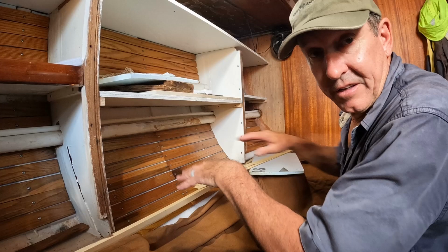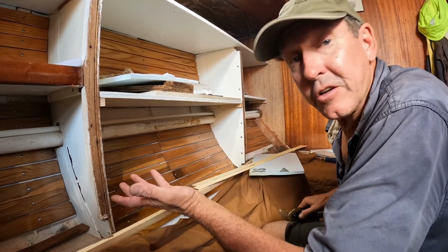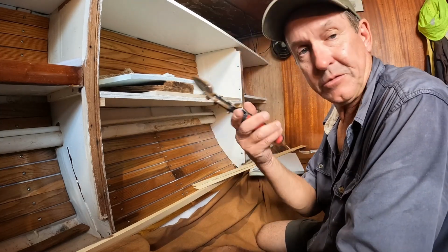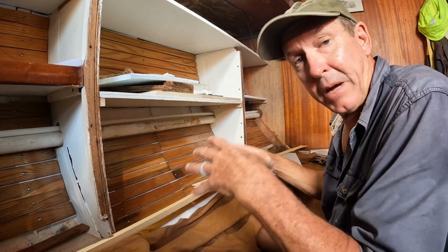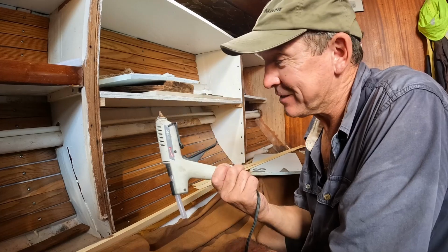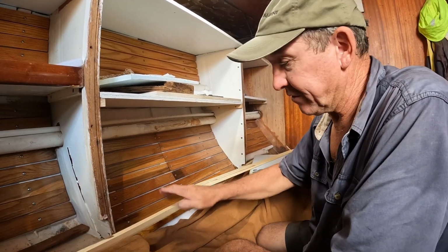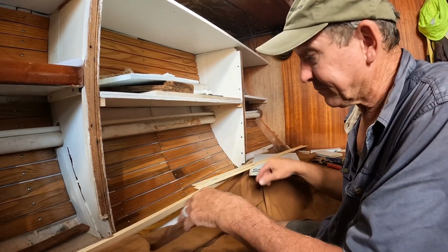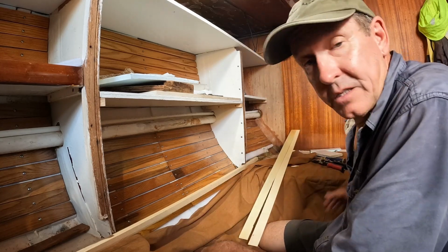And we need something to cut this, and since it's so thin, you can use a razor knife, you can use a stout pair of scissors, today I'm just going to use this pair of tin snips I had laying around. Now, to get the pattern to stay all together for us, hot melt glue. It's wonderful good stuff, and the hot glue is actually holding this cleat in place for us temporarily until we get our pattern made, and then we can just pop this off. So let's go ahead and get started.